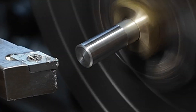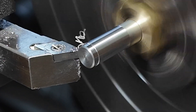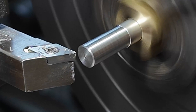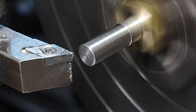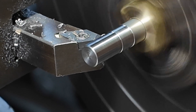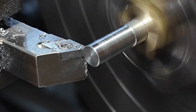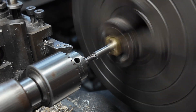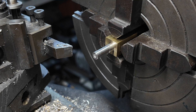And here we are back in the four-jaw chuck machining our shaft. I dialed it in using a dial gauge to get it as centered as I could. The slit just lets the four-jaw clamp the shaft firmly and prevents any marks at all. It worked really well actually.